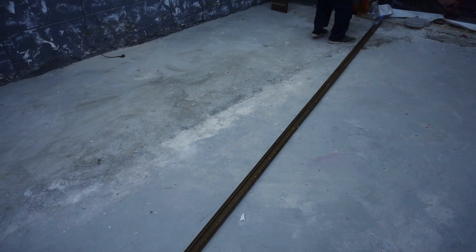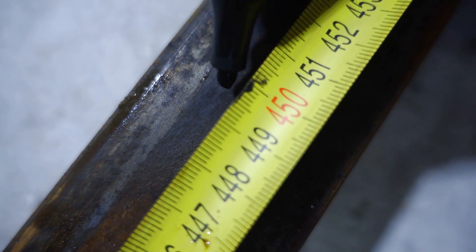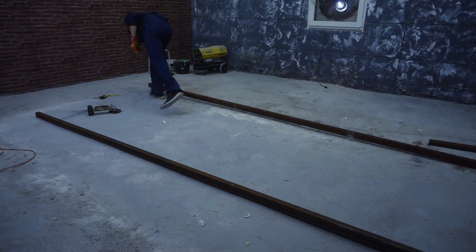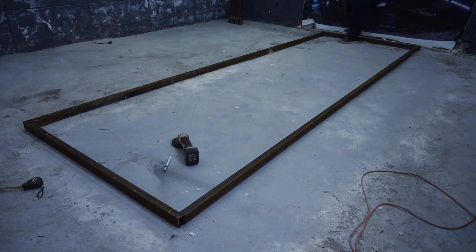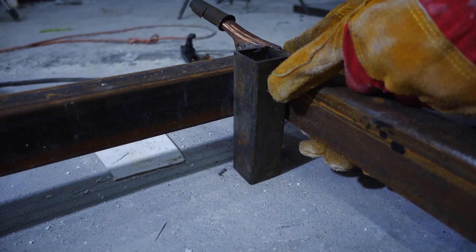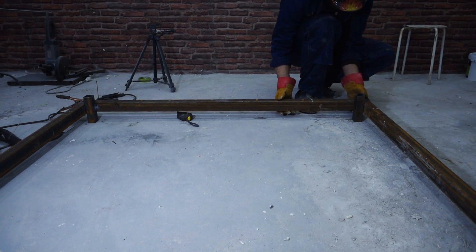For the construction, I'll need a slipway — a metal frame on which I'll be assembling Tesla's body — and my project will be started here. I bought some shaped tubes for the slipway: 60 by 40 with a wall of 3mm. I'll likely use them later on the strength elements of the frame, as this pipe is quite rigid. The sizes of the Tesla's bottom are yet unknown, so I'll prepare the slipway with an arbitrary width. I'll also need this iron piece to align the floor plane — it will be the zero point. To expose the absolute level of the slipway, I used a laser level, measured height by the corners, and welded the legs.